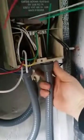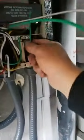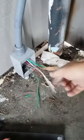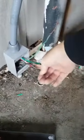Now for the pigtail for the load side of the transformer — while I'm getting all these wires pulled through, I'll address the wiring on the load side of the transformer. There are two black wires; each equally carries a load to run the pool light, so it doesn't matter which one connects to which wire. You can see the two black wires here — one will connect to the red wire and one to the neutral.